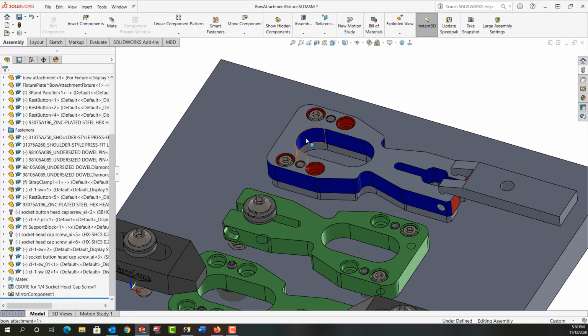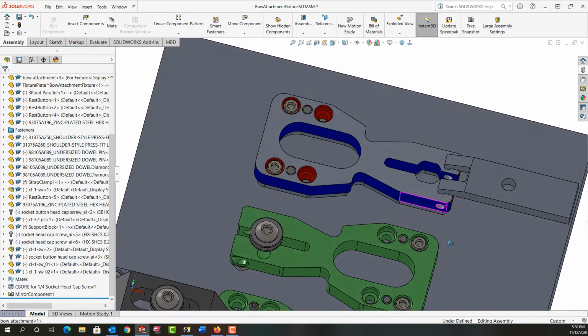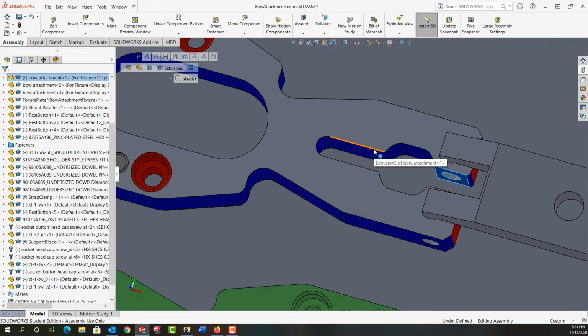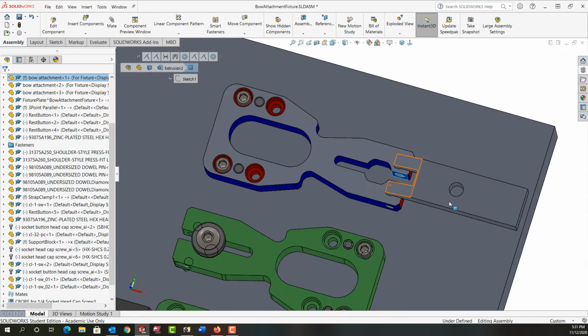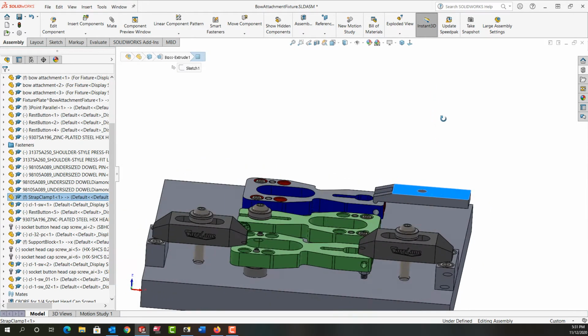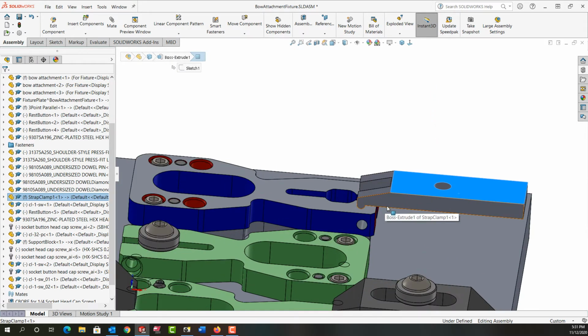Well, this area will be okay. This side and this side will be reasonable, but I think we might need to rethink milling this slot. It's going to be very difficult to get a clamp here and work around it, as you can see. Even if we make our own strap clamp, as this one represents, we're going to have quite a hard time.